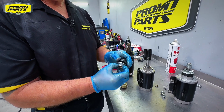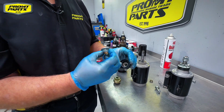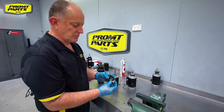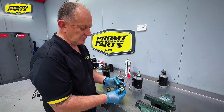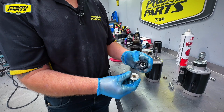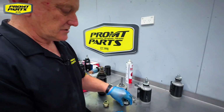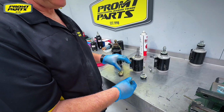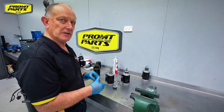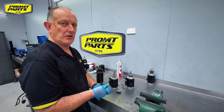the flywheel. But any lubricant on this starter helix can contact the friction face of the rubber cushion, and that will immediately cause it to slip. And that's what's happened in this instance. This starter Bendix has failed because you can see lubricant has come out onto the friction surface, and obviously you don't want lubricant anywhere near any sort of a friction surface. So key to where you put lubricant, and make sure it's well and truly away, and sprays aren't put in after. So that's all I've got to say about the American Bosch style of starter motor, commonly used on a lot of old American engines.